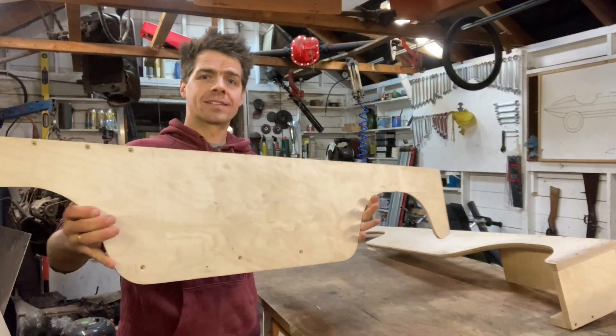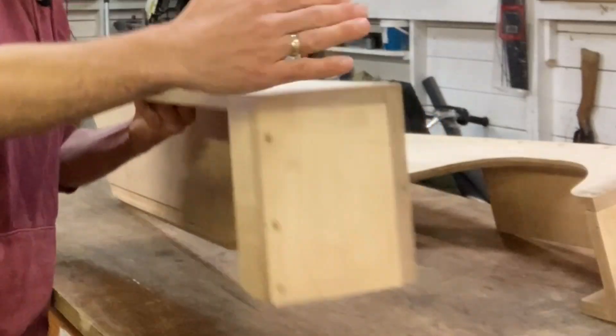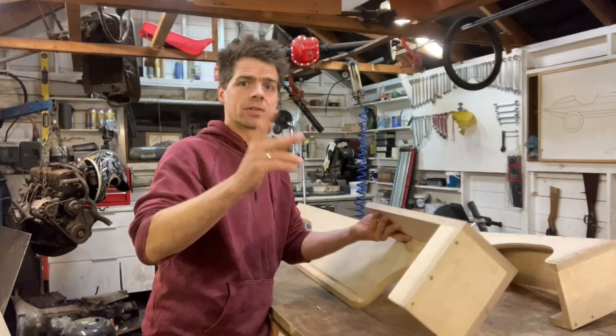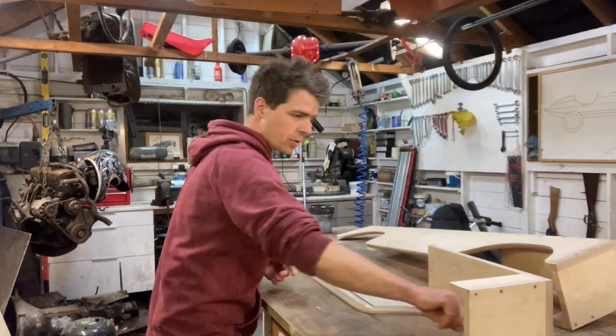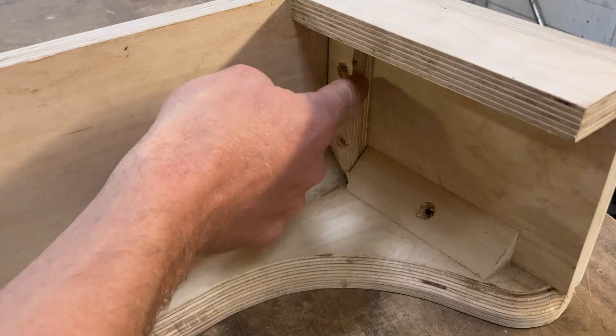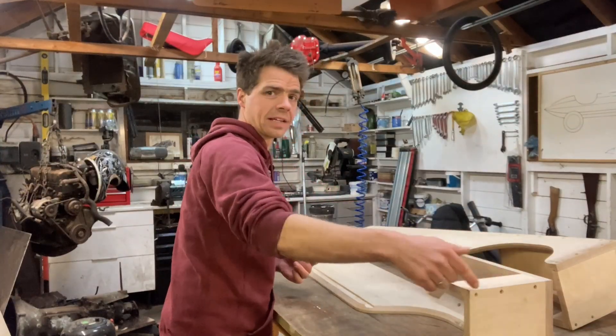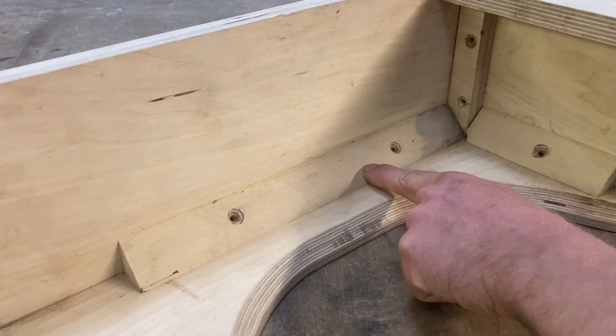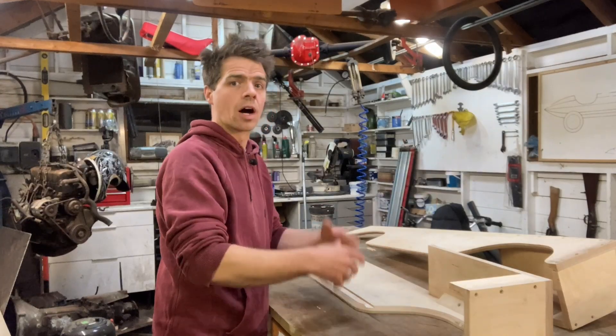This is one of my side sections. As you can see, I've now got the top of the wing, the front of the wing, and this side return that comes back to the radiator panel. On the inside I have put this corner section in — this is to allow me to machine a larger radius onto the top front edge, and these are simply to add some strength to the corner so that when I do cut the radius out I don't weaken the joint.